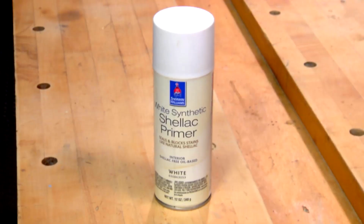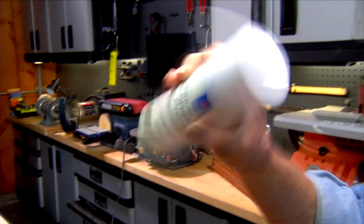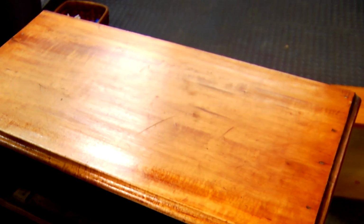So where does silicone come from? Well, the most likely source is spray or liquid furniture polishes. Repeated use over time builds up residue, which becomes apparent during refinishing. Shellac has the ability to seal off silicone, providing a barrier that isolates it from the new finish.